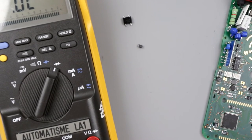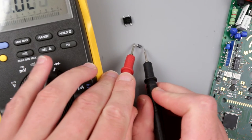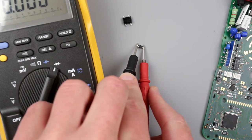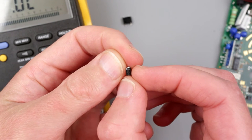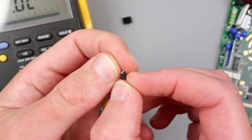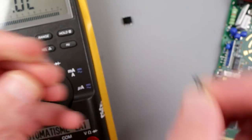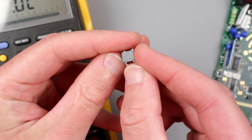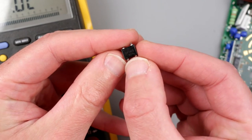In diode mode — yep, this diode is gone as well. This little diode reads as D81A. I have to search for this diode, but interestingly the service manual mentioned a different part number for it. And actually the service manual mentioned a different part for the bridge as well. Clearly these components were not previously repaired. So we need to order these parts and replace them.